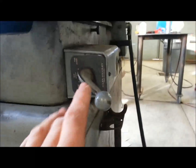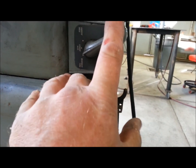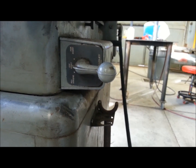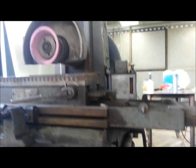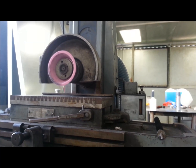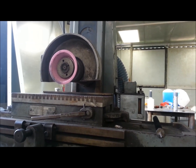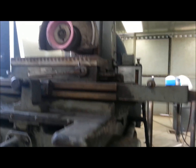This was an interesting tidbit — it's got a forward and reverse switch, and I'm wondering why anyone would ever want to run it in reverse. It didn't make any sense to me why someone would put a drum switch on there and want to run a spindle in reverse — you'd risk spinning that nut off. It's got a reverse thread, so when running forward everything is tightening itself; running in reverse, why would you want to do that?